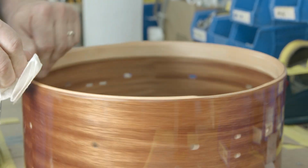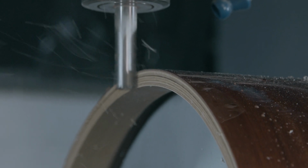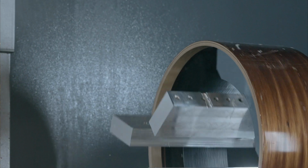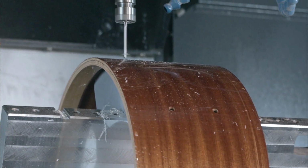If you look at the drums, they have a series of holes around the radius of the drums, perpendicular to the center line of the drum. There's some milling that has to be done. Also, the drums have to be machined to the appropriate length of the drum. And that required a Hurco 4th axis, but the center line of the 4th axis was not high enough to get a very big drum in there.